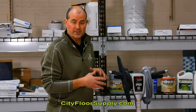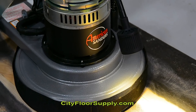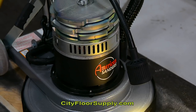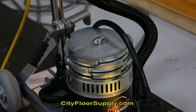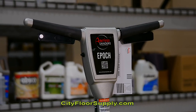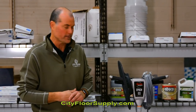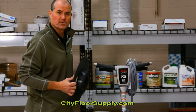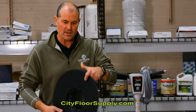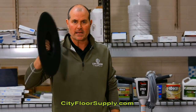The Epic came out and is one of those hybrid style buffers — this is truly a two-in-one buffer. You get an aggressive cutting floor sander with this unit using the hydrosand, the weights, and the RPMs, but you also get a standard buffer which would drive a screen or anything you would normally use for finish sanding a floor. The unit comes with a drive block for a 16-inch Mighty Lock drive block.